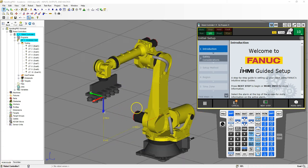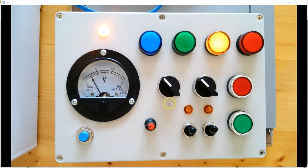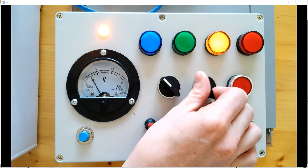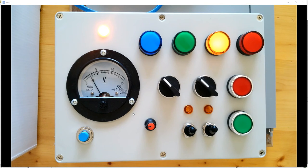On screen right now I have the 2000IC robot with an end-of-arm tooling, which is a bunch of suctions, so it could have some electronic solenoids — it will definitely have some pneumatic and vacuum pneumatics. I also have on screen a PLC setup where we can interface between the robots, so if I hit start it will actually start the robot, or I can turn on a laser, turn on another tool, or end the actual program itself. There are multiple things we can interface with a control panel or other sensors to an actual robot.